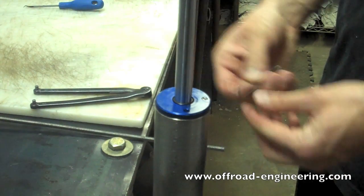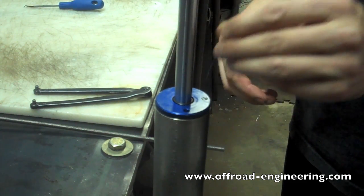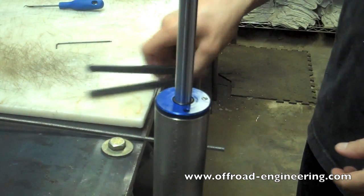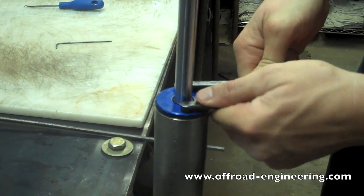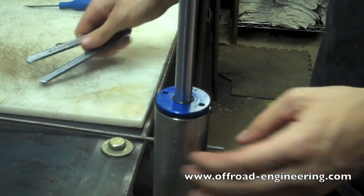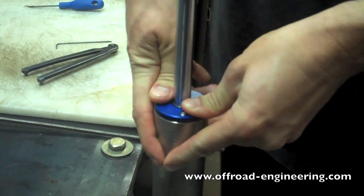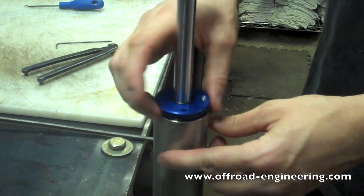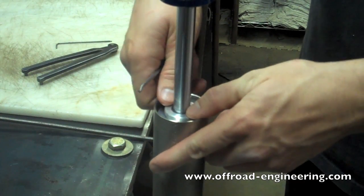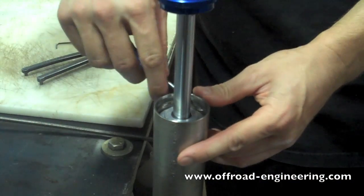Step 2: Remove seal cap and shaft assembly. Loosen any set screws or bolts and remove the end cap. A disassembly tool here is helpful for end caps that are threaded on. You will need to push the seal assembly down to expose the snap ring — this can usually be done after the dust cap is removed. Use a pick to remove the snap ring.